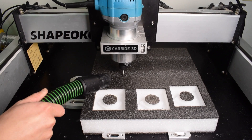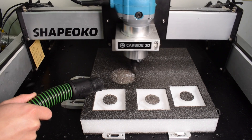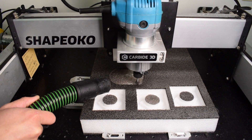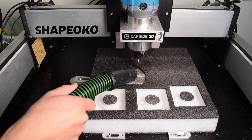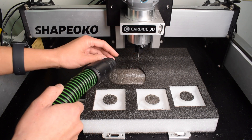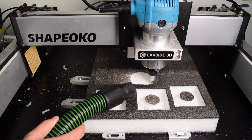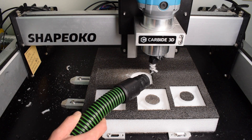I bumped up my limits by 500 percent. I ran a couple tests at max RPM and 275 IPM and it seemed to me that the cutter wasn't even struggling, so I went up to 400 inches per minute. To really show the advantages of that kind of speed you need to be cutting something larger, so I made a bigger test cavity. Here I started noticing strands of foam getting wound up around the end mill - this is what I'm calling the Grimsmo conundrum - where normally you'd want long flowing tool paths, but in foam you can't, because these long continuous cuts form long continuous strands of foam. As far as I know, Datron deals with it by using a ton of compressed air, but the downdraft from the router isn't nearly precise or high-velocity enough to guarantee that you'll keep the free end of the foam noodle from getting caught up around your end mill.